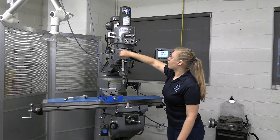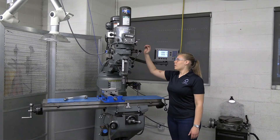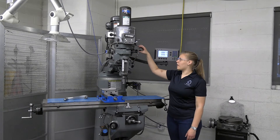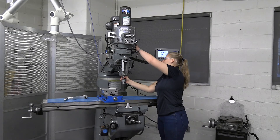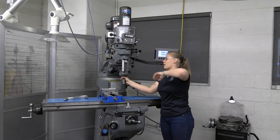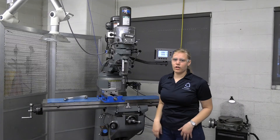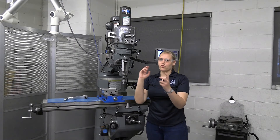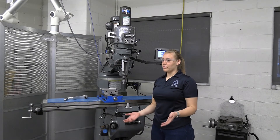In low gear the machine runs at about 75 RPM — you can hear the difference in speed. To put it back into high, most people mess up here because after hitting neutral it goes almost to high but not quite, so just turn the speed dial and it clicks into high gear. You'll be able to tell if you're not in gear because the machine will start screeching as you can hear the gears grinding — if that happens, turn it off immediately and double-check your gears.